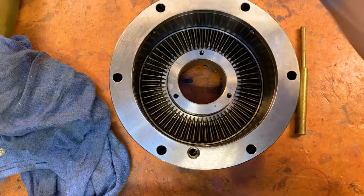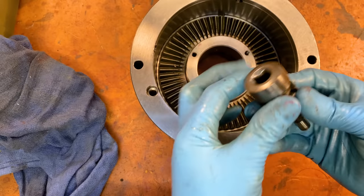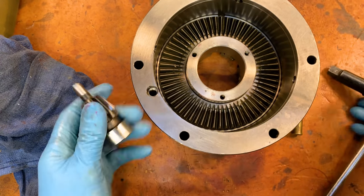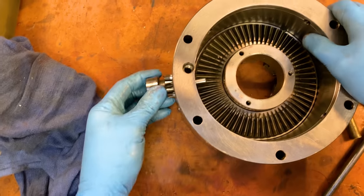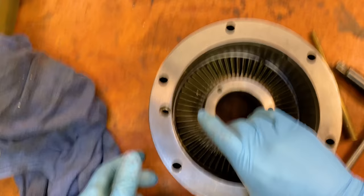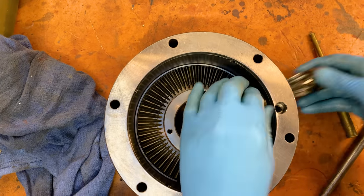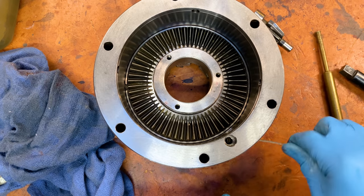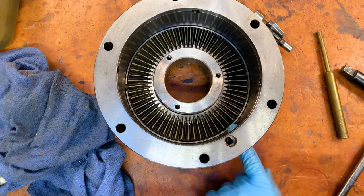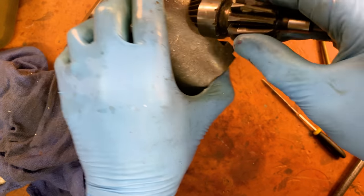This is what my chuck key activates. The chuck key goes in here — I'm going to have to hammer it in, but it engages. It goes into this little hole right here, and I'm going to sock it in. It's a tight fit. Just in case there's a burr on this hole, I'm going to relieve the outside edge. I don't want to affect the bearing surface because it rides on that — and that's still in good shape.